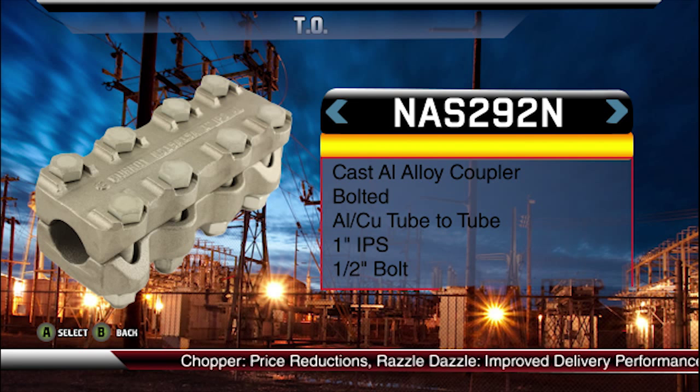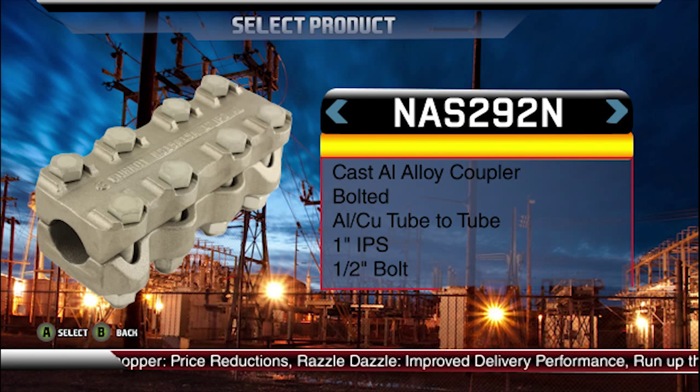You are correct Burn. Substation couplers allow utilities to create a straight continuous cable-to-cable, pipe-to-pipe, or pipe-to-cable conductor run while transferring the desired current. This product line has all the angles covered as there are products that can accommodate angular bus configurations with angular couplers.